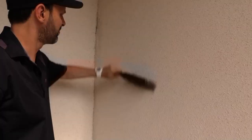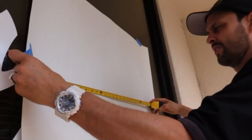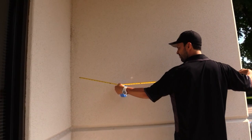If installing outside, make sure the wall has been dry for at least 24 hours. A damp surface will keep the adhesive from properly bonding for the long term. For prep, simply clean with a brush that has plastic bristles. No alcohol or wiping down required.